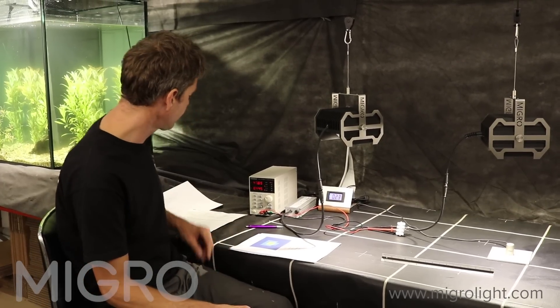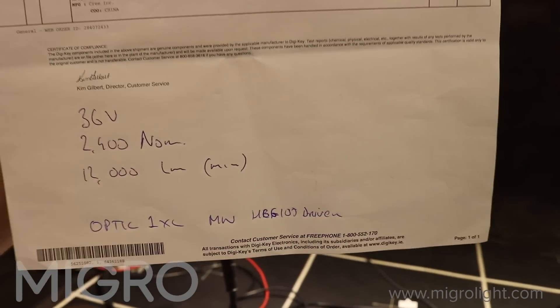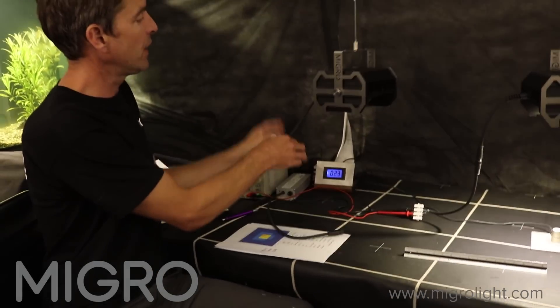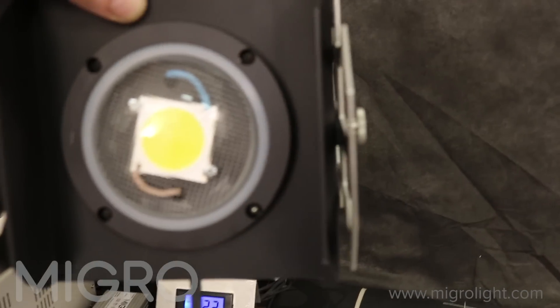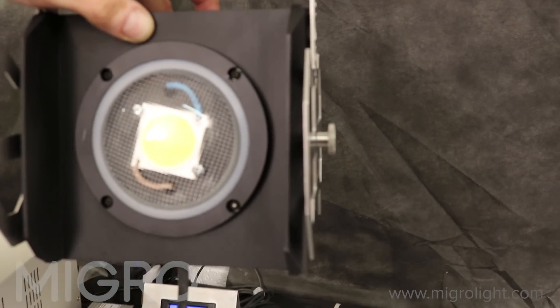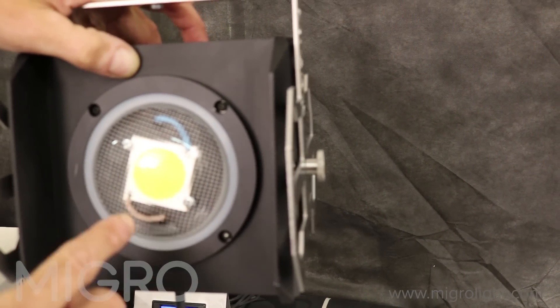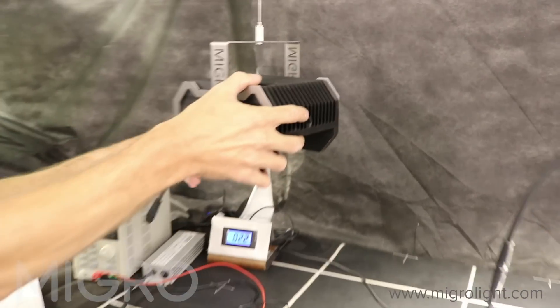Just taking a closer look at our setup. This is the Cree CXB3590 CD top-bin — just got it in from China. It's a 36 volt, 2.4 amp nominal, 12,000 lumen minimum LED. We've mounted the Cree chip on the Luminous setup, inside on the heatsink with thermal paste, and we are using the same glass lenses with the Cree COB as we use with the Luminous COB.